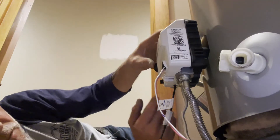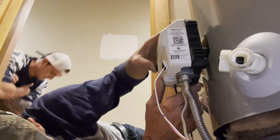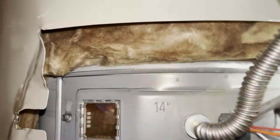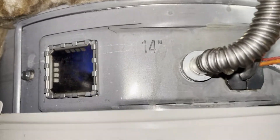It's time to spray all our gas connections with soap water. Push in to the pilot position, hold it while hitting the striker, and watch for a spark underneath. Being new, it's going to take a while for it to sequence itself and actually light, so have patience. And there you have it — that's how to replace a gas control valve on a residential natural gas water heater. I wouldn't mess with trying to replace a gas control valve on an older heater because you probably won't find the valve. Take your time, safety first, follow the steps. Any comments or questions, leave them below and don't forget to keep plumbing.